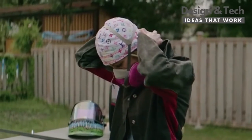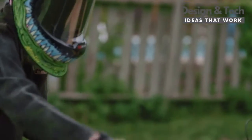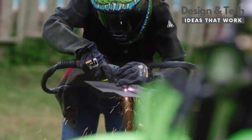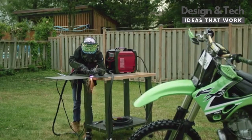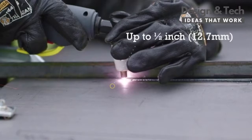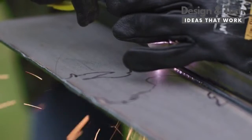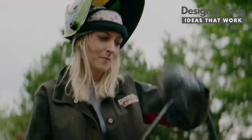The MP200 is more than a welder — it is also a plasma cutter. After connecting the gun and compressed air, you may set up the pre- and post-flow duration and choose two-touch, four-touch, or manually input the corresponding current and voltage. It is powerful enough to handle up to 12.7mm or half-inch steel. But power is not everything — its plasma cutter also excels in precision.